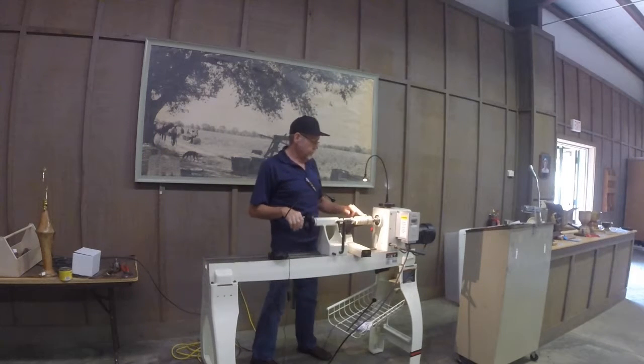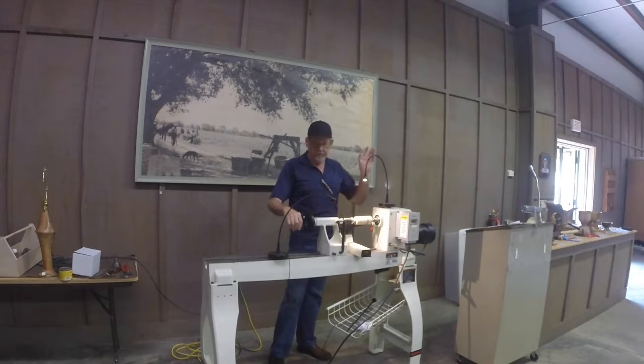I've got this. I'm just going to real quick knock this down, pass it around, and we'll be done because it's so hot in here. I don't want to keep everybody. But this is body filler, super glue body filler, and fiberglass resin. I like fiberglass resin as opposed to casting resin because it dries a lot faster. Casting resin to me is too thin to work with in a big area. You wind up having to build tape dams and everything else around, to keep it running out the end of it.